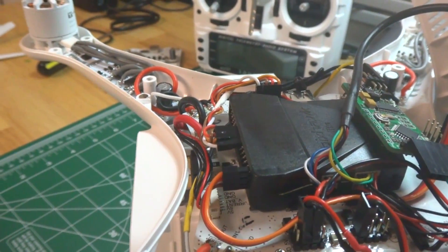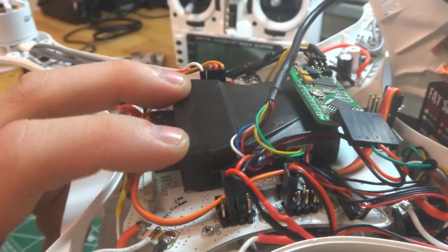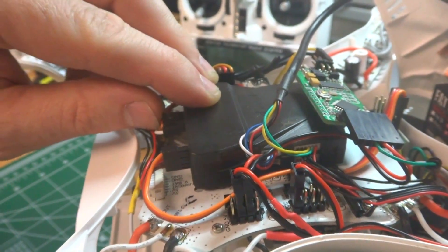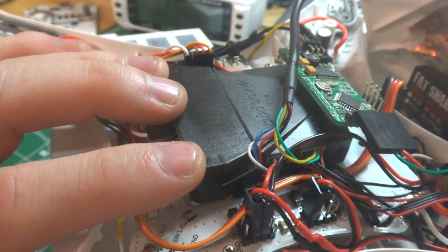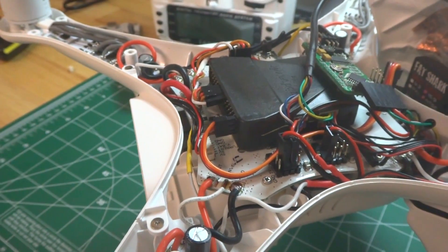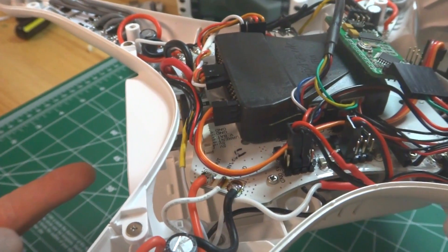You can also use a standard APM in this configuration, but what I found is that even an APM runs the full length of the board, and making connections is very problematic unless you start bending pins to get clearance for the shell to lay flat. I didn't want to do that. The other problem I had when I started with an APM was severe barometer issues, so I started looking for another flight controller — that's what steered me toward the Pixhawk Light. I definitely recommend it; it's a good flight controller.